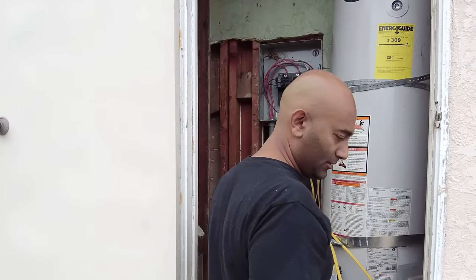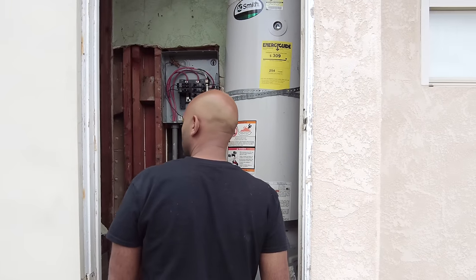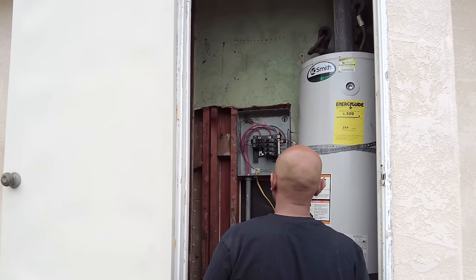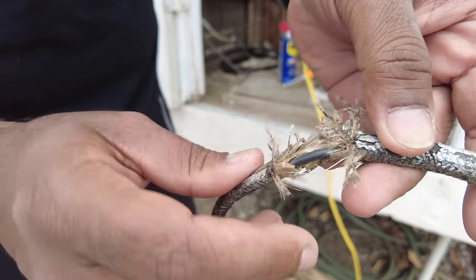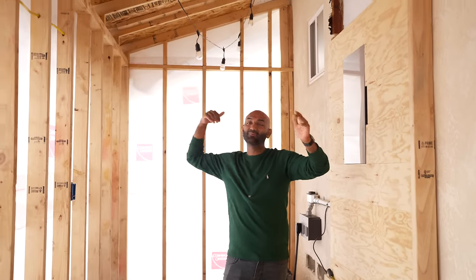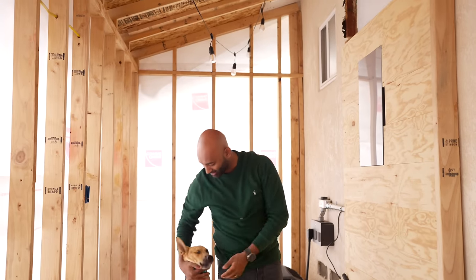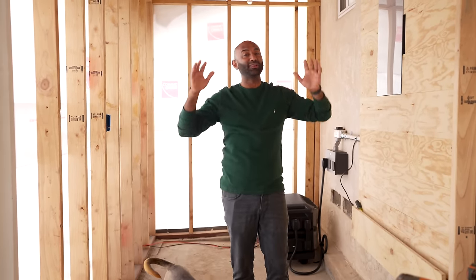Previously, that little closet we had just didn't have enough room, and it wasn't up to modern code, having separation between the water heater and the electrical panel. It was all just kind of a mess. And now, well, we have that space to do that. Plus, above us, we now have 6 times 33 feet of extra solar space, which we're gonna max out. Oh, what's up, bud? We're gonna actually completely deck this out, and we'll get back to the solar capabilities of this entire system here in a minute.